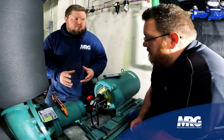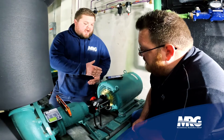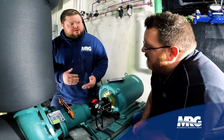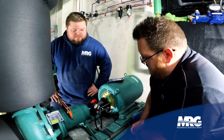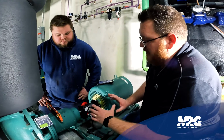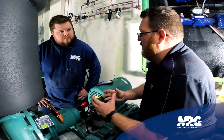What does the half number reading mean? When you're going through the app it's asking you to cut the measurement in half — there's a specific reason for that. It gives you true live readings of what's happening on both shafts simultaneously, since both shafts are active and live at that point, so you know exactly where you need to be.